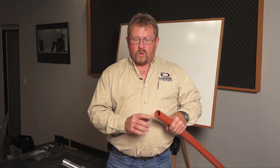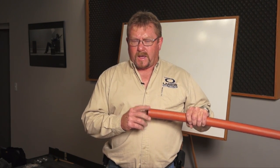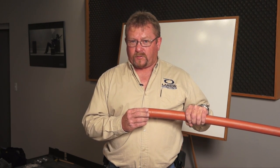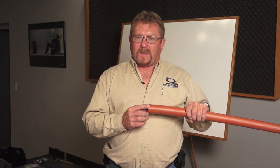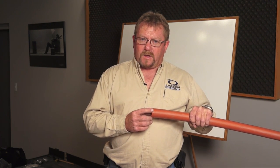That's why it's so important when placing duct to chamfer the insides of the inner duct. The further out we go and the cable starts slowing down, we've had good luck just slowing way down — maybe even stopping the drive tires for a bit — letting the air pressure build up in the inner duct, and then starting the tires again. A lot of times with smaller air compressors, they can't keep enough air in there quickly enough, so letting the air build and going a little further has been very successful.